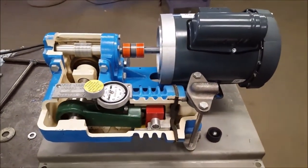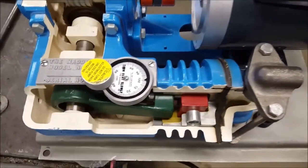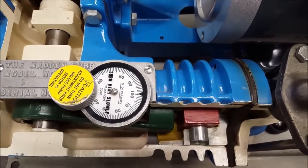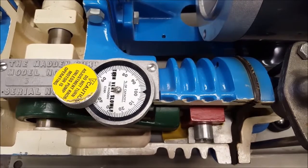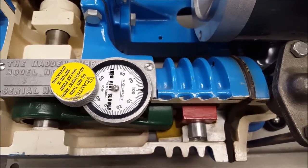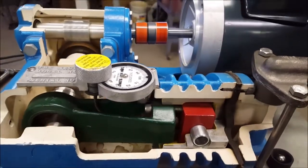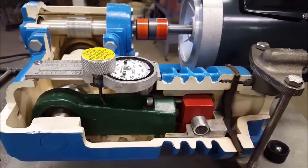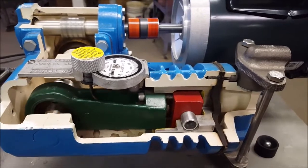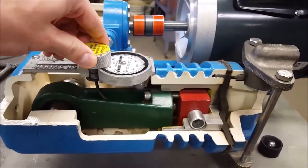Now we will focus on the manually adjustable output rod, which works using a loss of motion principle. This rod allows for a 10:1 turn down ratio of whatever pump model you have. So for example, this MF118 pump, which has a maximum output of 18 gallons per hour, output as low as 1.8 gallons per hour could be achieved by turning the knob down to 10. It is somewhat counterintuitive, but you should not shut off the pump to make this manual adjustment. Having the pump running allows the rod to turn more easily.